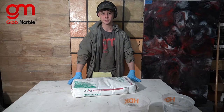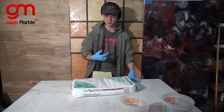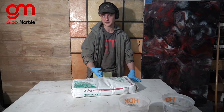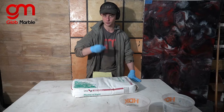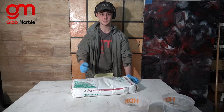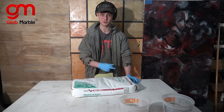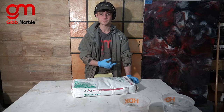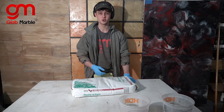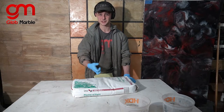First I want to tell you the benefits of using plaster over concrete. It's a lot faster to manufacture — you can de-mold in 30 minutes sometimes and get production going quickly. It's super lightweight, eco-friendly, and easier to cut and adjust. But plaster of Paris is more brittle than concrete and is only used for indoor applications. If you want to do exterior applications you could use hydrocal or hydrostone, but those are a little more expensive than plaster of Paris.